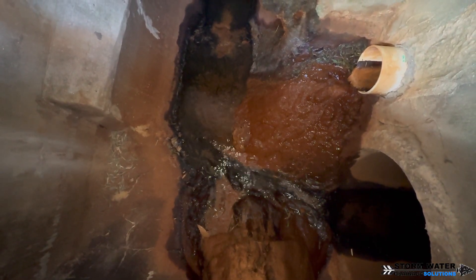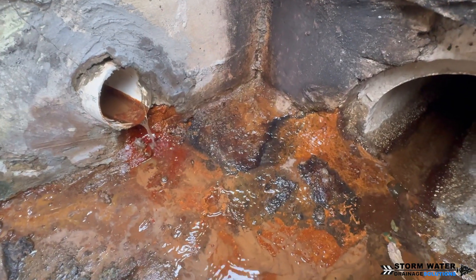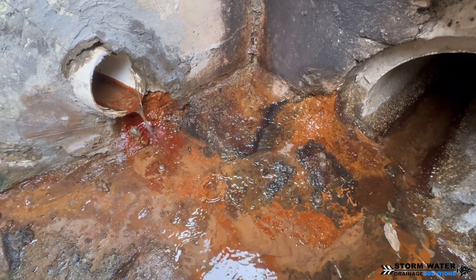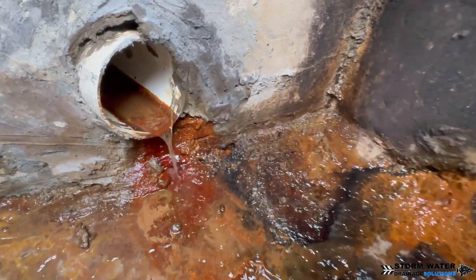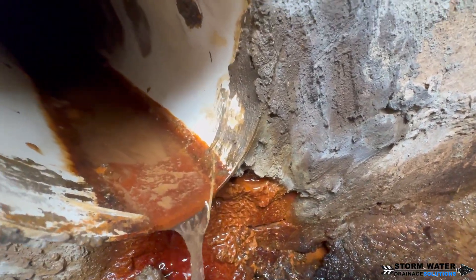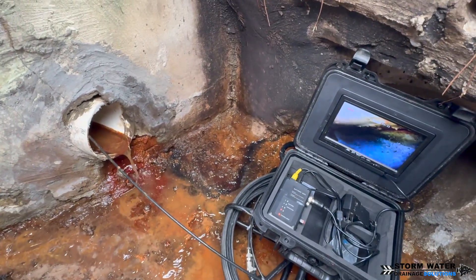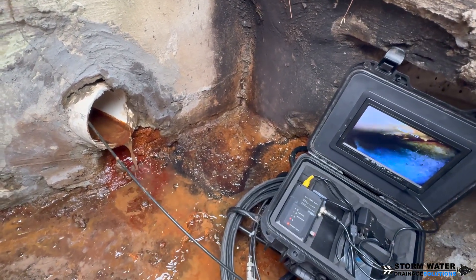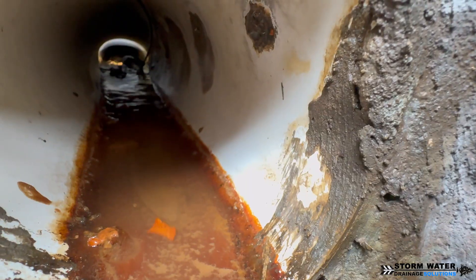In the areas of Florida that I work, the majority of the iron ochre that I see is this reddish-brown color. I've really never seen white or gray in real life, but I have seen it in videos. Now, as this stuff dries out and it oxidizes, it becomes hard. So the longer it is in there, the harder it becomes to remove. Iron ochre is not harmful to humans — if you touch it or get it on you, it's not going to hurt you in any way. Now, it is harmful to plumbing systems and drainage systems because over time, as it oxidizes and it hardens, it can fully clog up a section of a pipe that it is forming in.